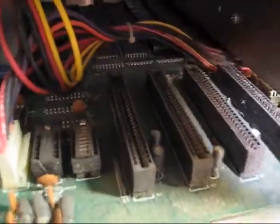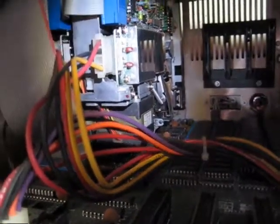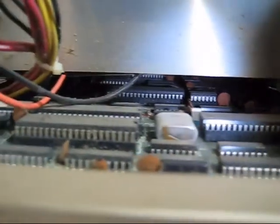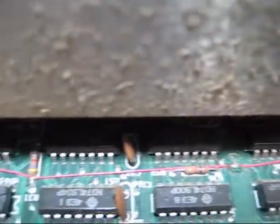While we've got it open, let's take a peek deeper inside. There's the main board serial number — on this one they've got the Corona name on it instead of contracting out to another manufacturer. This is also where your four expansion cards would go. Over here there's a blank socket for another chip, and I'm not sure what exactly that's for. You can also see the top of the floppy drives — I'm used to having floppy drives with some sort of casing on top, but these are completely exposed. Looking on the other side, you can see there's not much room under the CRT for the sea of chips populating this board. And here's some sort of factory bodge going on between these two chips — again I'm not sure what this was trying to fix.